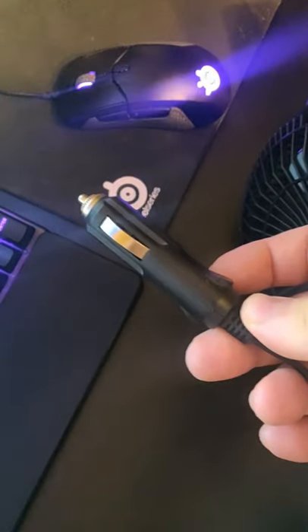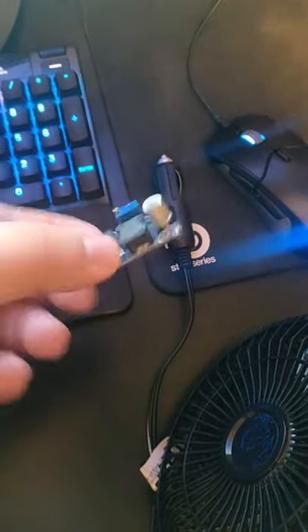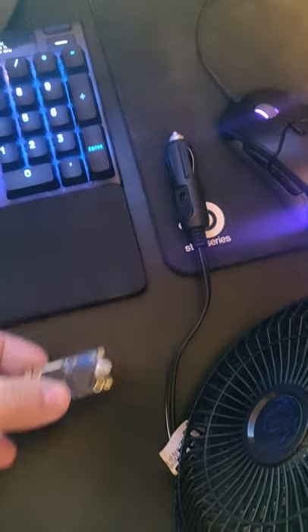Here's my issue. It's hot as fuck. I have this desk fan, but it's a 12 volt connector. I have some printers that are 24 volt power supplies. I'm gonna take this buck converter, lower the voltage from 24 to 12, power this fan. Let's see how it goes.